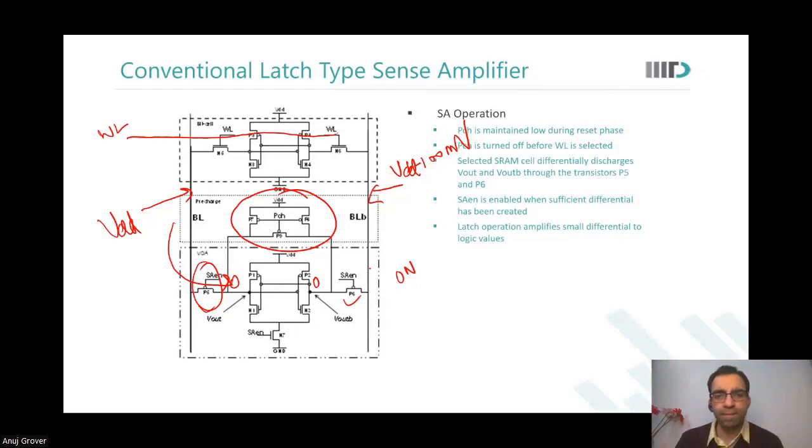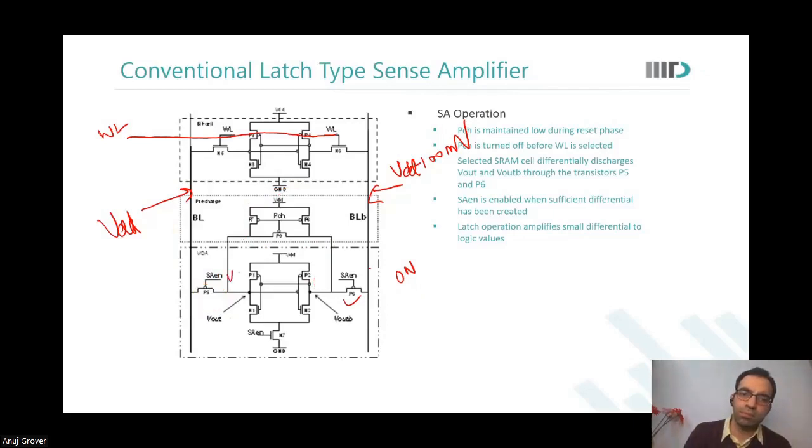Okay. So, sir, just explain this condition with VDD also, once. Because if I take VDD, then I'll be writing back into my VDD minus 100 millivolts, right? And I am not supposed to connect those both nodes directly because they are at different potentials actually. So what is happening? There is a PMOS here. One side there is VDD, the other side there is VDD minus 100 millivolts. The PMOS is on. So what would happen? Sir, I think that's a little bit discharged. This VDD will also get discharged. That is what you wanted, no?